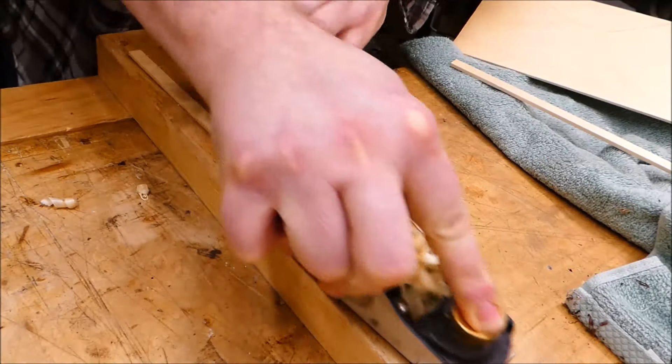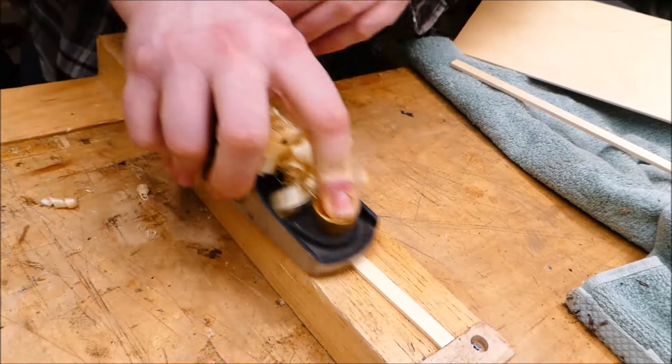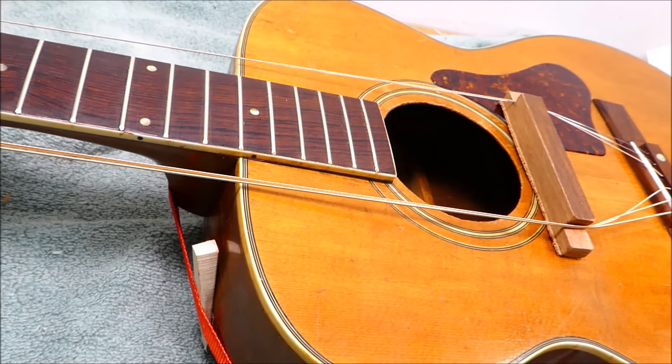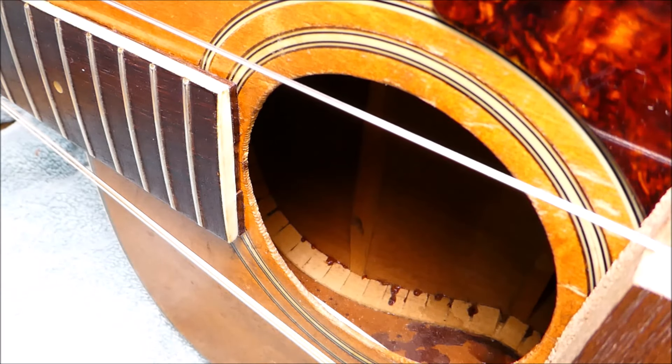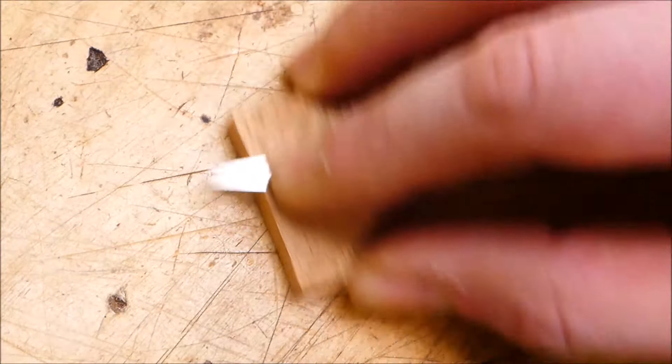Back to making cleats. I guess this isn't a short and sweet little update anymore — you get to watch my descent into a maelstrom of lunacy. Was it hubris? Am I Icarus with wings too close to the glue? The main offender runs right along the top of the curved lining strip. I have to bridge it with cleats, and to do that I need to pare away part of that lining. So I've made up a little cutter that I can drag along the back and score through it.